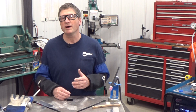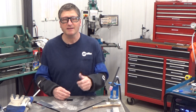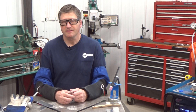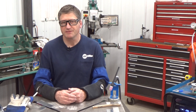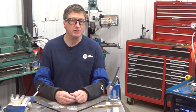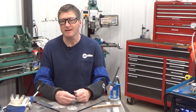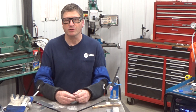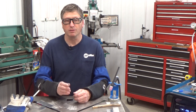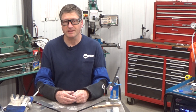You don't want the arc so tight that you have to move the TIG torch side to side to tie in the two base metals. You'll want to practice some of these settings to see where they might fit your needs. And remember, don't work against the machine. If you're looking for a wider weld but your frequency settings are still high, don't just throw more amperage or power at the puddle — you might over-penetrate or blow through your material. Adjust your frequency to suit your joint designs.